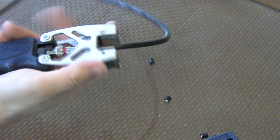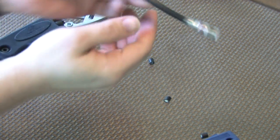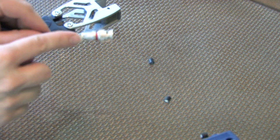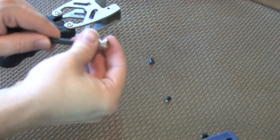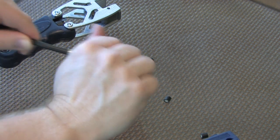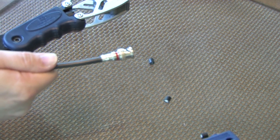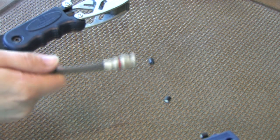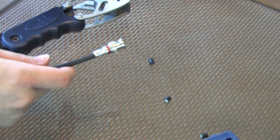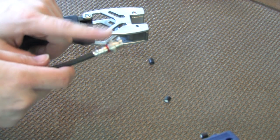Once I do that, I pull my handle back up, pull my jaws back, pull my BNC connection out, and take a look. I can see that I've squeezed down tightly against the outside jacket of the cable. You can give a little tug on the BNC connection to make sure there's no movement and the cable does not pull out. If there's any movement, you don't have a solid compression connection — it's probably partially made. You could try compressing it again, but most likely you'll need to cut it off and start again with a new connection, as these are one-time use connections.